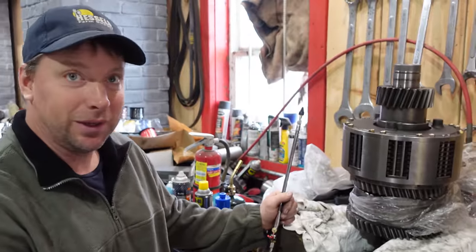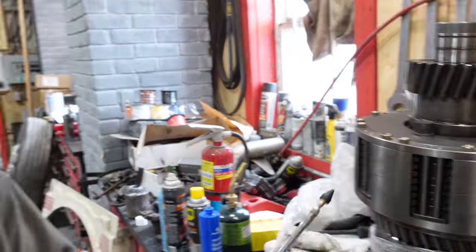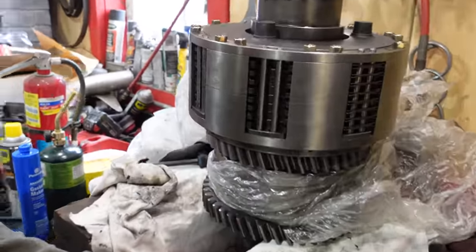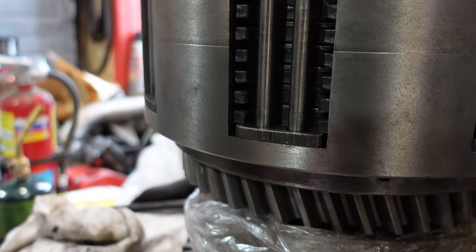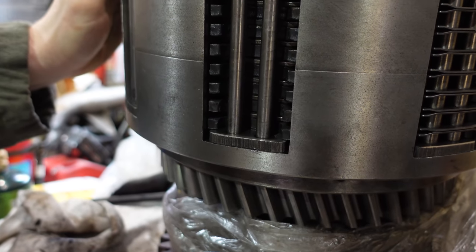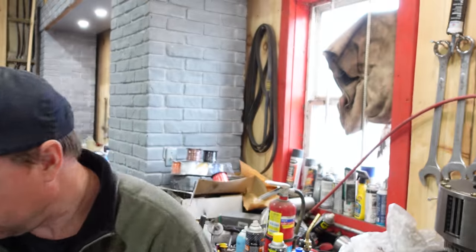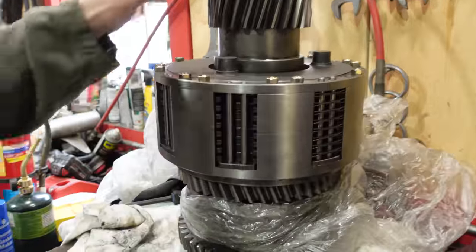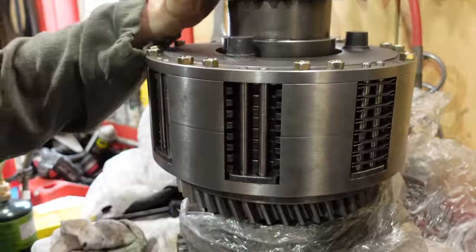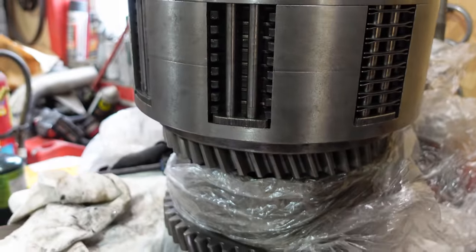All right, we think we got it set up. So I had it in there. We were adjusting. Put some air here, I'll show you. A little air to that port. That's what you got. That's 7.5 mil. Need 7 to 8. So we're good. 7.5 millimeter? Yeah. Because you want to have it able to free go. That's less than a centimeter. That moved more than a centimeter. No, it didn't. Yes, it did. 7.2.